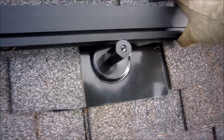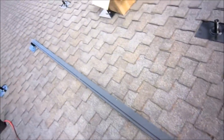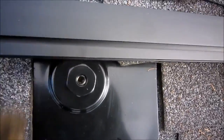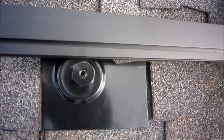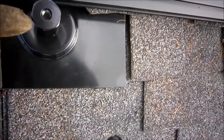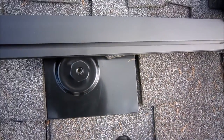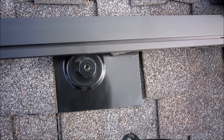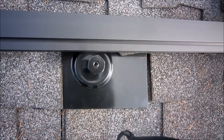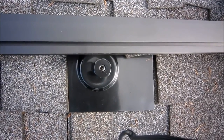You can see that between my rail going from one end to the other, I'm a little bit out. When you put the L bracket on top, it goes here and then it goes up. It does have a slot and you've got about an inch to work with when you're trying to put your rail across the roof, so you don't have to be precise to the eighth of an inch — plus or minus a half inch is fine. You'll have no problem getting your rail up there.